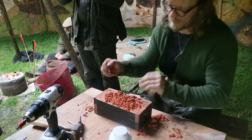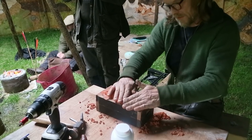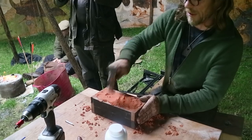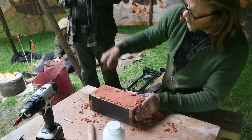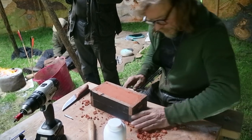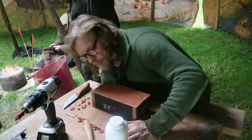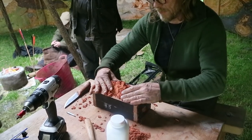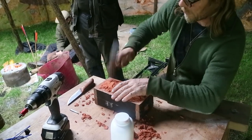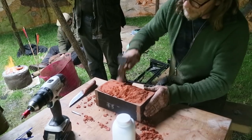Now what we're going to do is start teaching this thing that sand can fit in here — that technically doesn't belong in here — by hammering it, which you're all going to love, because it's all about compaction. Turn the knife over; you've got a flat back. Close it. Move your sand out of the way, give it a little bit of a shuffle, turn it over, go again. Keep turning it over as you're compacting it, otherwise you'll be driving your axe through. You can also put your hand over the pouring cup to keep it from pushing out.